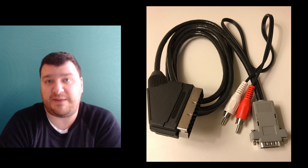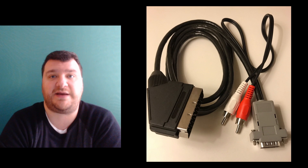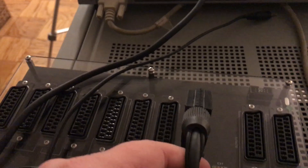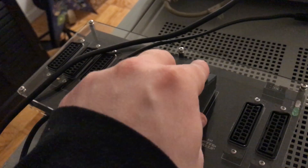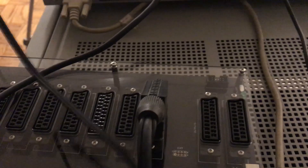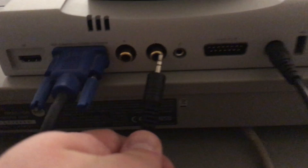The way I plan on using it is through a VGA to BNC or VGA to SCART depending on my setup. For analog output, if you already have a SCART setup, you can have a VGA to SCART cable made for you — or if you already have a SCART switch, you don't have to change cables at all. You could grab a SCART head for a few dollars, cut off any VGA cable, and splice in audio as well.